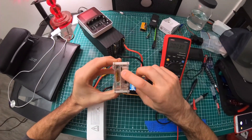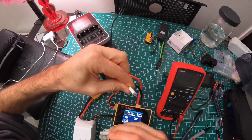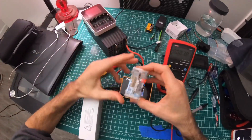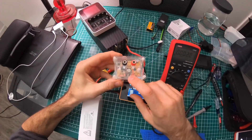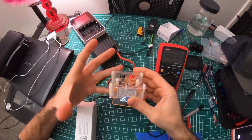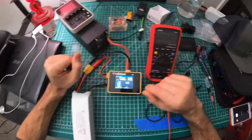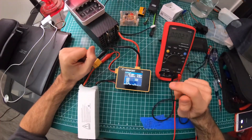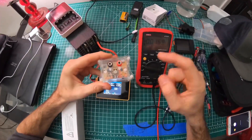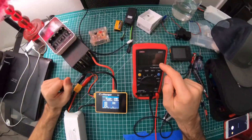You can just use a traditional micro USB charger — like a phone charger — to power the reference. Plug it in, turn it on to whatever voltage you're going to sit at, let it warm up for about 20 minutes to reach 25°C, then calibrate your meter to this reference. Then calibrate the iCharger to the digital voltmeter.